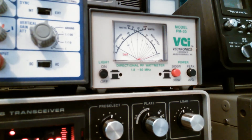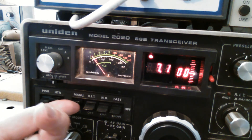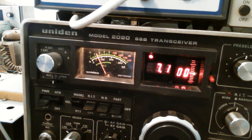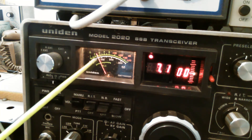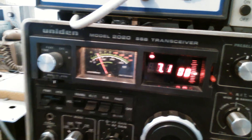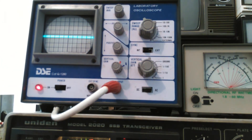I've gone back to just under 10 watts of output and I'll go to SSB now because I wanted to show you with no drive what the standing current is. On the meter we're on the green triangle — the red triangle lower is for when the radio is operated on 10 watts only, but the green triangle is for full output. That's 100 milliamps on that scale, so you're looking at 65 to 70 milliamps of standing current for the two output tubes. I've got a two-tone generator plugged into the microphone socket. Looking up at the oscilloscope, I'm bringing up the mic gain.